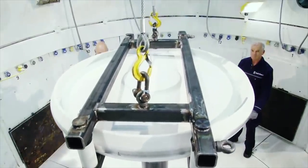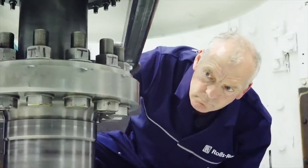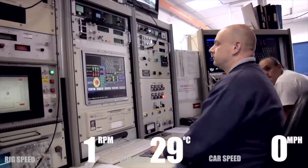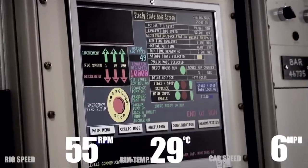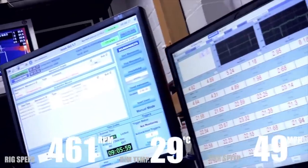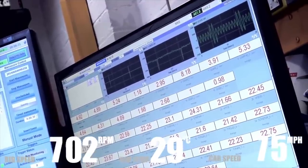So we're very fortunate working with Rolls-Royce in Derby in that they let us use one of their spin test rigs. It's a test cell, a box where they would normally put a disc from a jet engine. They can spin it up to full speed. And we did that. We took it to the top speed the vehicle could ever see, to give us a safety margin. That's spinning at about 10,500 revolutions per minute, so 55,000 radial G. That's a kilo of sugar weighing like 55 tons on the edge, and it's trying to rip the metal apart.